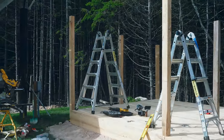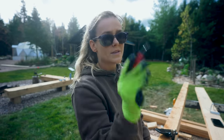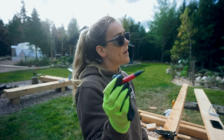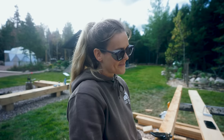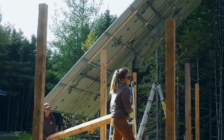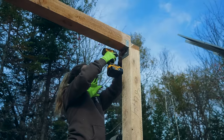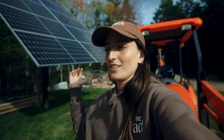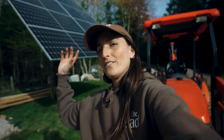We're about to fabricate the beams. We need two 12-foot pieces for both sides. In the middle, they notch together and support each other to support the weight of the wood and the roof and the snow on the roof in the winter. So what the notches do is they act as an entire support — that way not half the roof is just on one beam and the other half on the other beam. It disperses the weight of the structure.